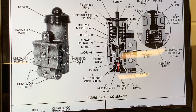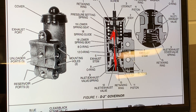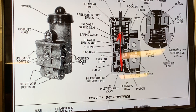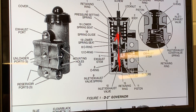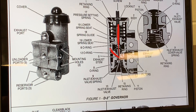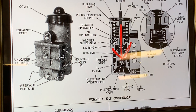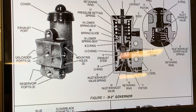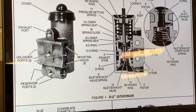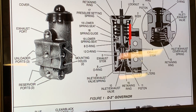Air also flows around the piston, which is slightly larger at the upper end. The added force resulting from this larger area assures a positive action and fully opens the inlet valve. As it drops 20 to 25 PSI from cutout pressure, the spring becomes stronger than the air pressure on the bottom of the piston, causing the piston to push back down, closing the wet tank to the unloaders and opening the passage from the unloader and purge valve to the exhaust port.